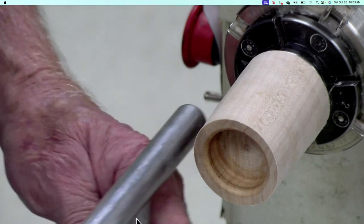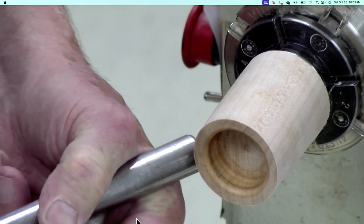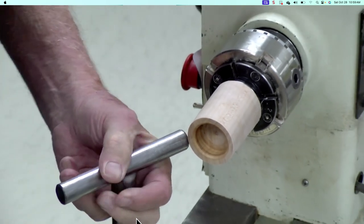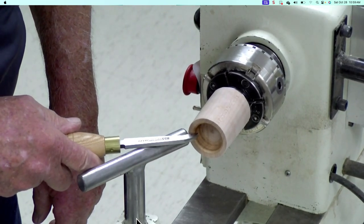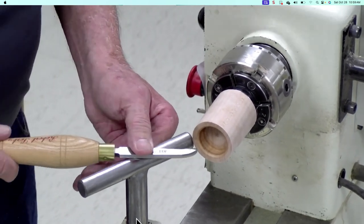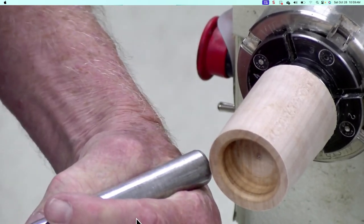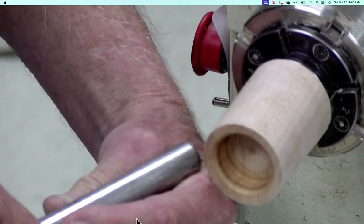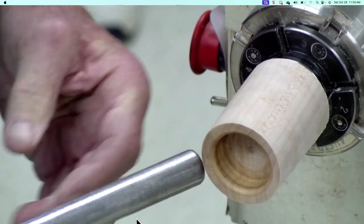Okay, so look, we're going to take this at about a 45, roughly. Ooh, what happened there? I want this to be slightly high. In other words, I'd like the bottom of this chaser to be at center height, and maybe a little higher. The nice thing here, that's not nice. That's right at the end, isn't it? Did we get another one of those?